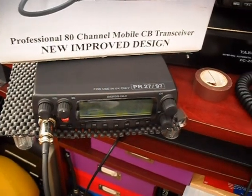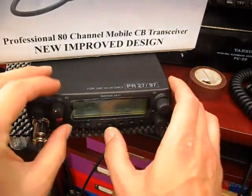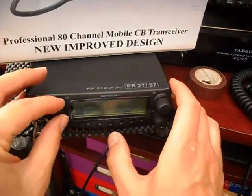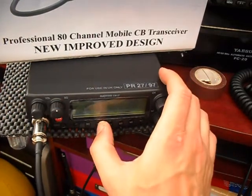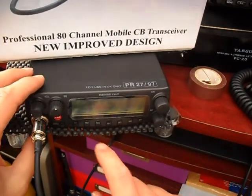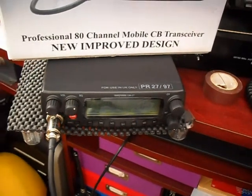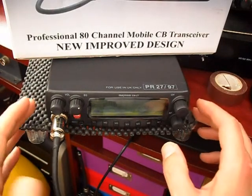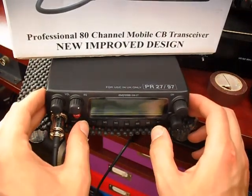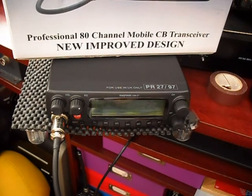It can scan each block individually and 4 watts output on each band. The rig itself does lend itself to various modifications — I know quite a few people have modded the M27 for 10 metres for wide banding. We'll just put this one into scan mode, just in case it might be somebody coming up on one of the channels. There's a bit of sideband coming through at the moment. Very easy to get it onto the EU band — it's the flick of the M1 switch and then the appropriate switch across to the EU setting.